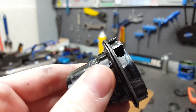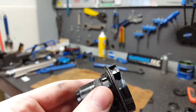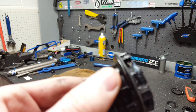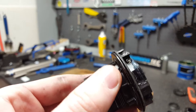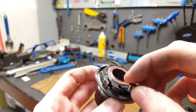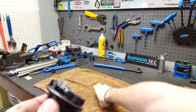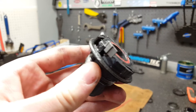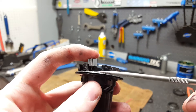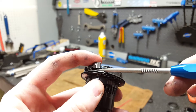For the installation of the pawl and the spring, it's actually fairly simple. There's a little hole that you're going to put the spring inside. Take that spring — careful, don't lose it — and slide it in there. Then you're going to slide the pawl in from the top. Note the orientation. You'll notice that it doesn't go all the way down, so you're going to have to compress that spring to put the pawl inside. What I'm using is a little pick. I'm going to take one finger to hold pressure on the top of the pawl, slide the pick in, compress the spring, slide the pawl down, and then release.